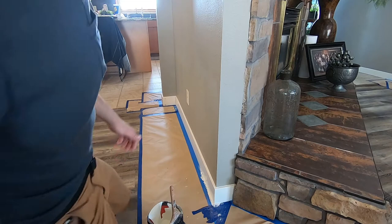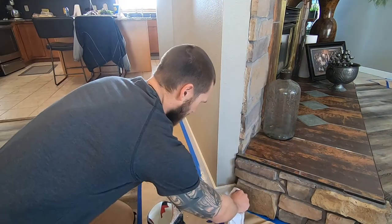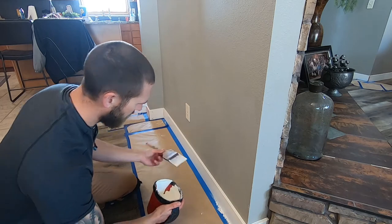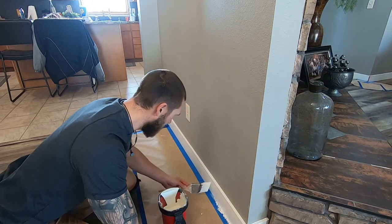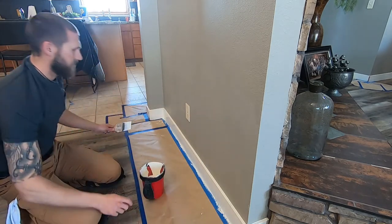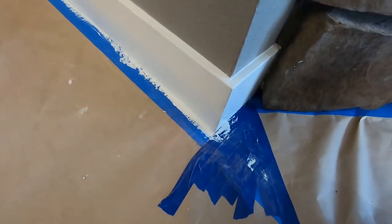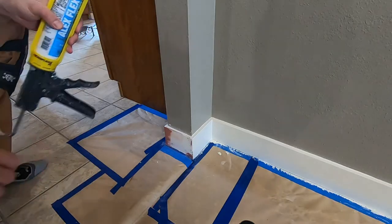You can see just with one coat that Bondo disappears. Almost forgot the one rule of painting — always have a wet rag on you for wiping up paint. If you get it fast enough it'll come off. What I like to do is get my corners, cut in along the top. You can see where that Bondo was — it cleans up very nice. The big thing is try not to put it on too heavy where it's going to run on you.